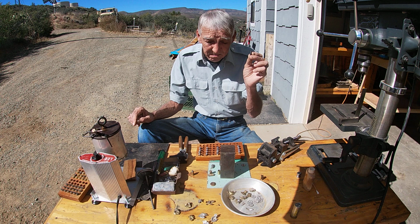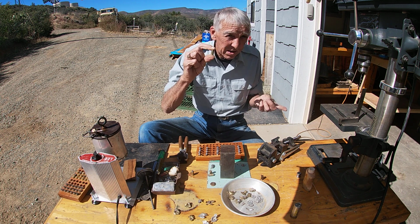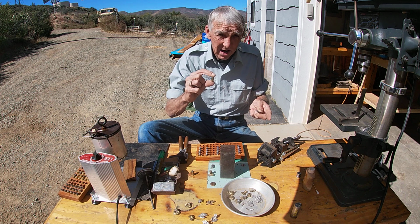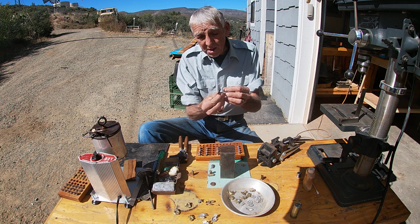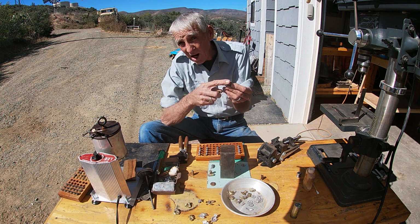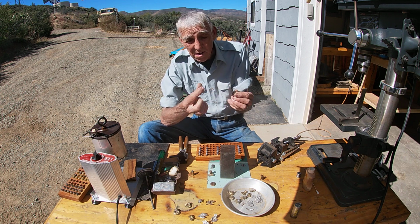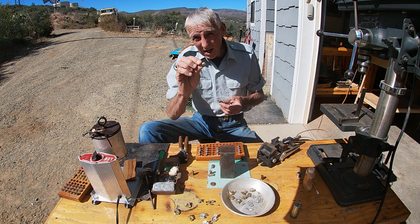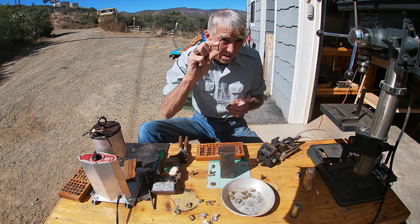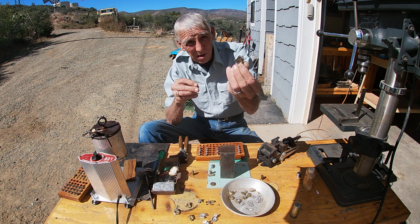Now, your 9mm cartridge is exactly like 390. So you'll be using a 27/64 bit to drill out your mold, whatever mold you have that you don't care about anymore. We were shooting these 9mm bullets, putting 147 grain full metal jacket bullets inside of them out of the 410, because 147 and your average empty 9mm case weighs like 60 grains, plus or minus. And you're 3/4 inch long. So remember that. But here's the result of a full metal jacket inside of a 9mm.